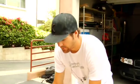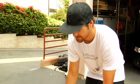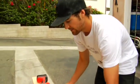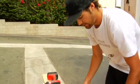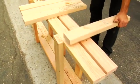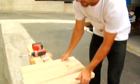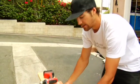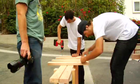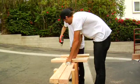Now if you cut 4 more 2-foot pieces, you're going to use these. These will be your supports on the side. And we're going to do the same thing with these. Drill a hole on each end. And that way you'll create a hinge, you know, hook there. And yeah, be good to go. So we'll get to more drilling. I have to do 2 ends in each of these. Also in the center at 1 3/4 and 1 3/4.